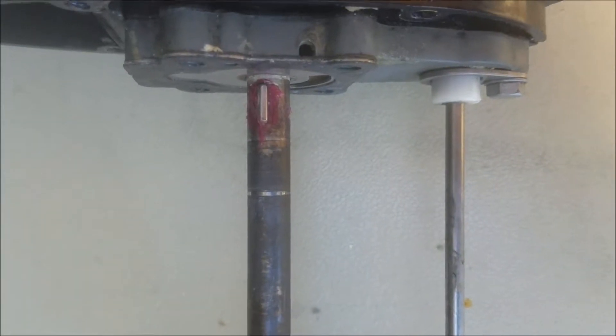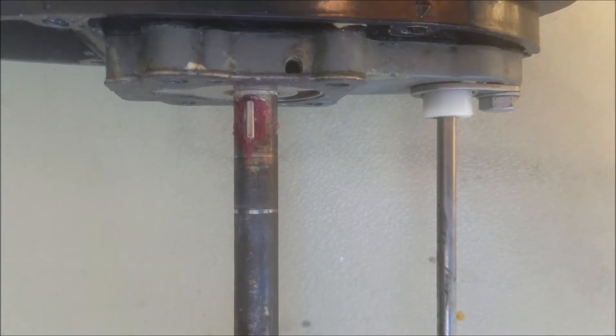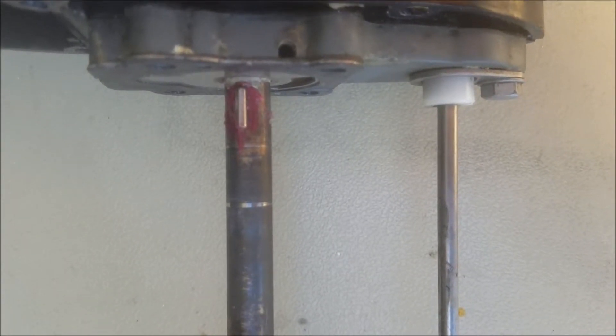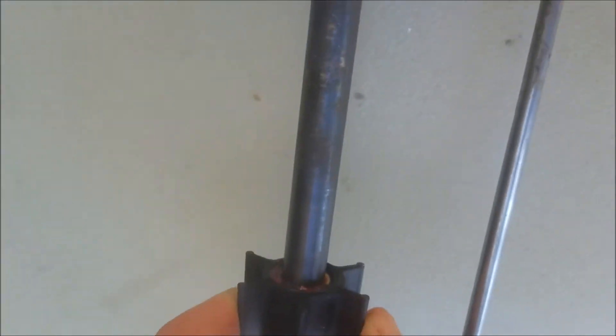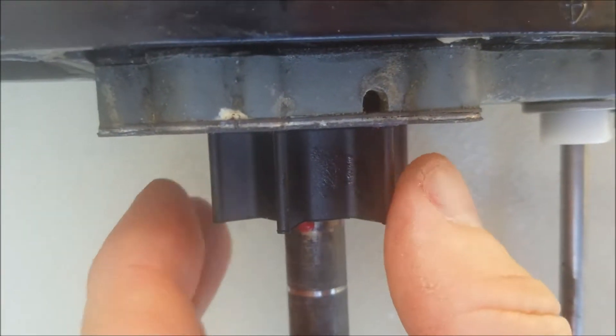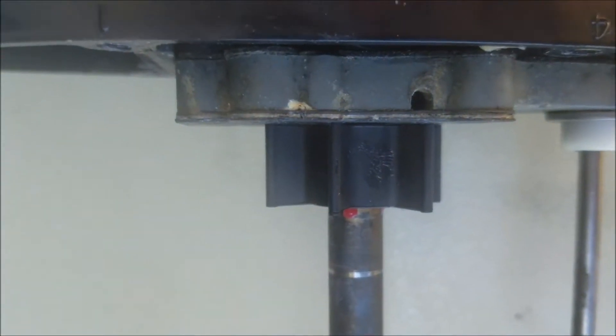I got the key in place. As you can see, there's a flat spot on the shaft that I put a little grease on to hold it in place. I'm going to slide the impeller down, find the slot on the impeller, and match it up with the key. Sometimes you've got to wiggle it a little bit — you can see it's going on. If that key is not there, the impeller will not work; it won't rotate.